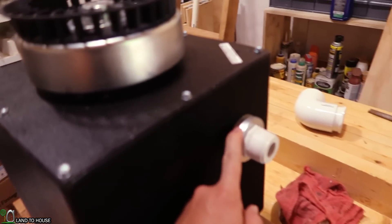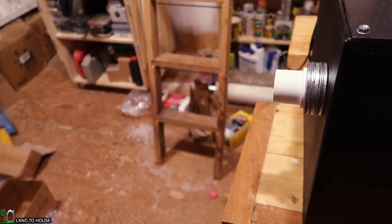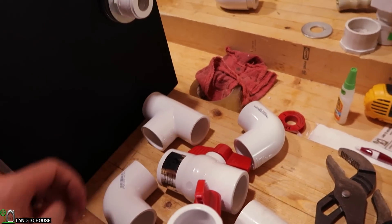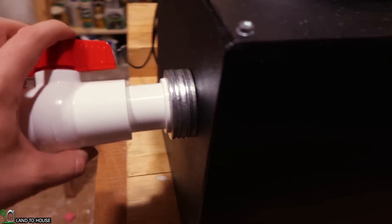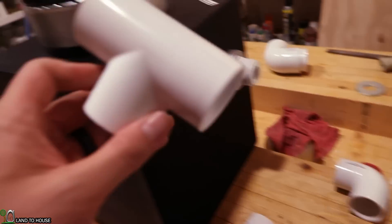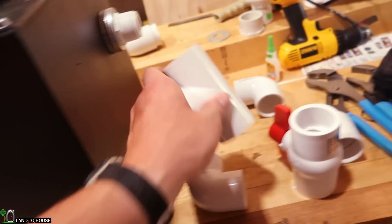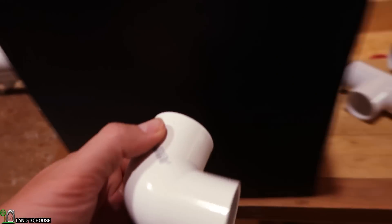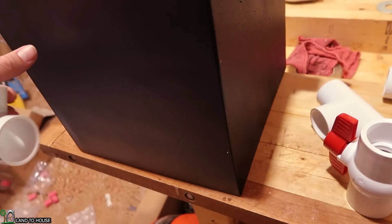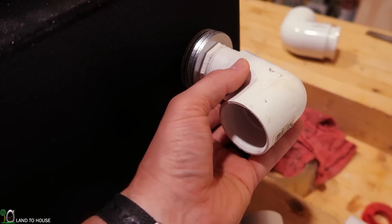I have the two jets. This is the quarter inch and this is the 3/16ths, so it is very tiny. What I want to do is get these plumbed up so they can be used one or the other individually. I've got a couple of ball valves and then several 90s and a T. I'm thinking that I'm going to be putting a ball valve here on this side so that will control this on or off, and then I'm going to put the T piece on that. The main line in from the mountain will come in right there, and then that will 90 off of there, come this way. I'll have the other valve in there and then this will 90 over to this last 90, which is threaded here. Let's go ahead and get that put together.